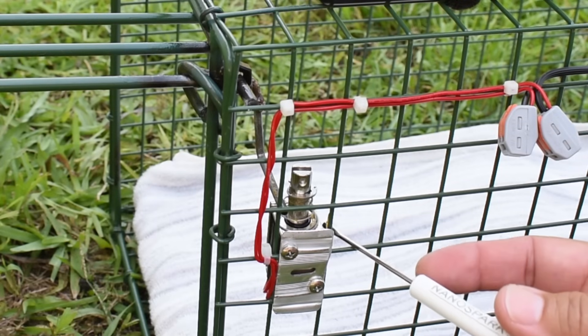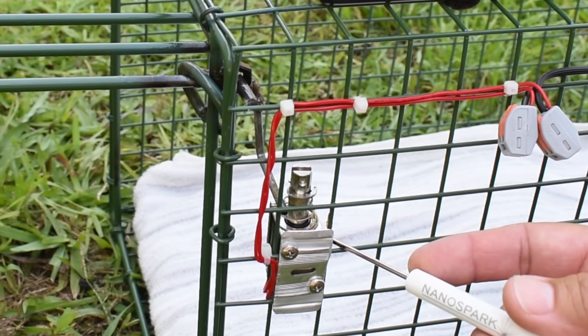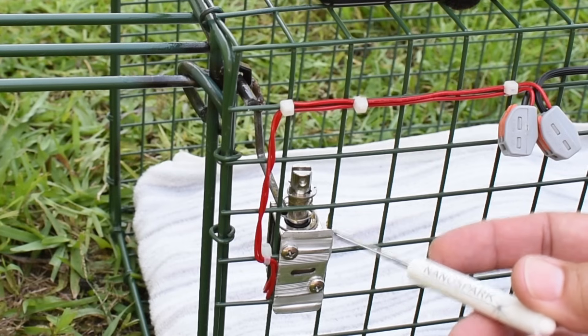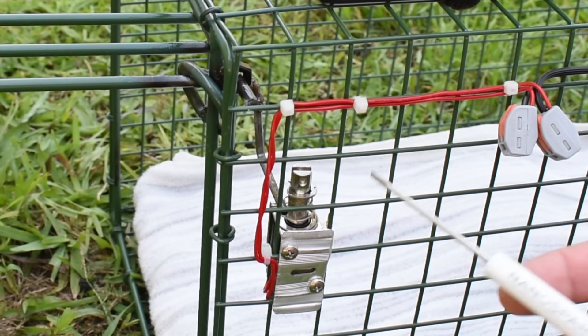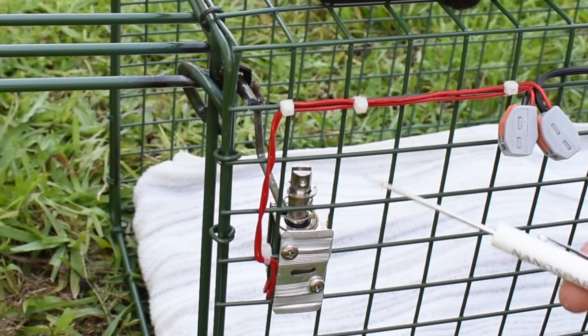I'll put a link in the video description for this solenoid. I believe it is a 30 or 35 newton, 12-volt — so around six or seven pounds of pulling force. You want to make sure you use the same rating or even one that's slightly stronger, so instead of 30 to 35 newton you might want to go 40 to 50 range. Of course it's going to draw more current — this one here is 1.2 amps; a 40 to 50 newton will probably draw two to two-and-a-half amps. It's really not a big deal for the battery in this control box since you're only triggering momentarily, not a constant load. You could charge this battery using an RC charger and this will last a very long time, even on standby while you're waiting to trigger.